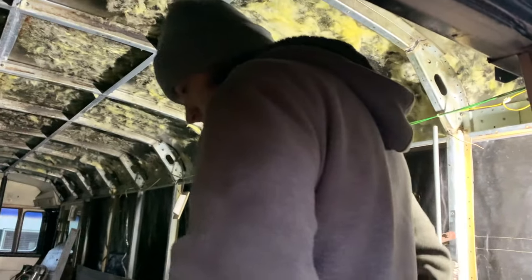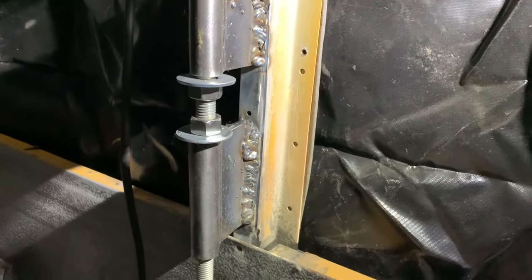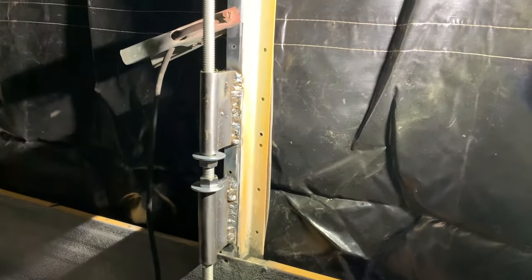All right, I couldn't film Nathaniel welding any of that because I had to be inside constantly flipping the breaker. Yeah. Discovered that it's only a 15 amp circuit, not 20. And oh gosh, look at that, since you had to stop so many times and it kept dying on you. Yeah, it looks awful. Well, we're not going to blame you for that.